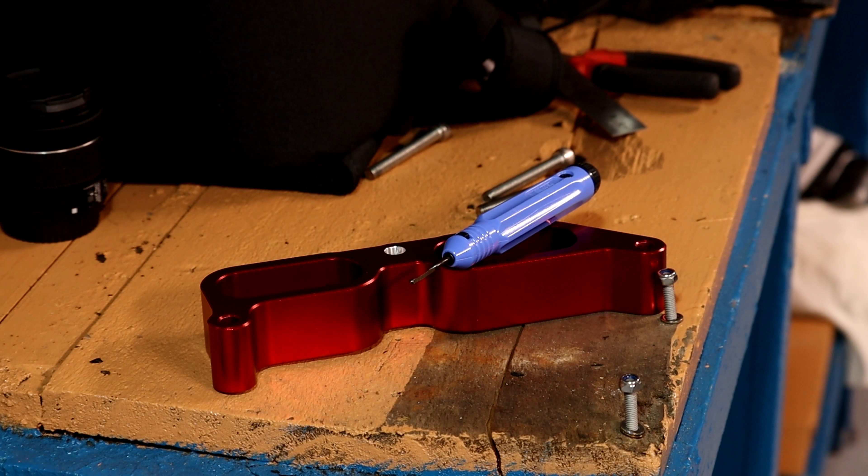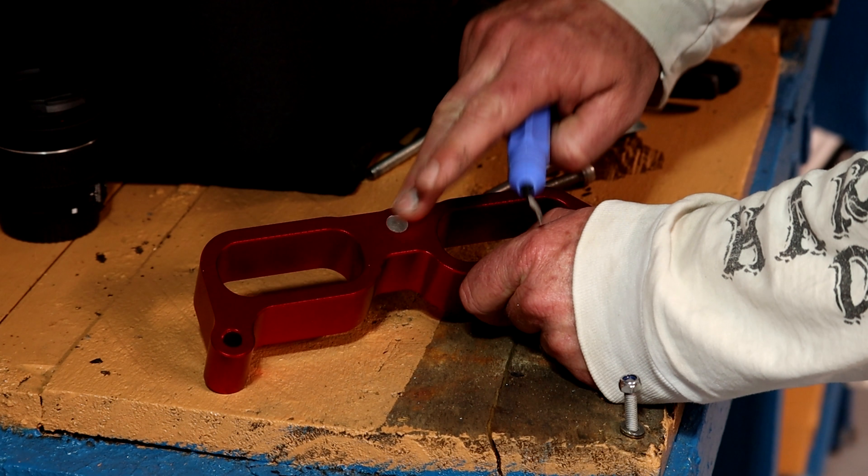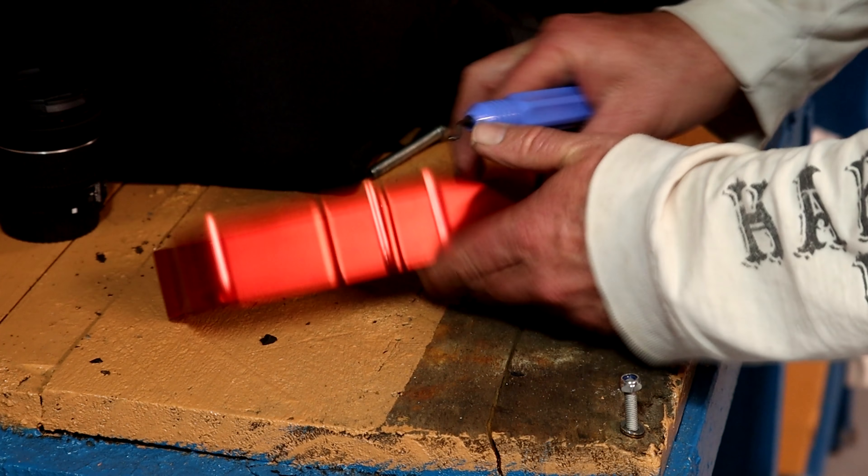We've run the drill through so I've just cleaned up the edges with a file and a deburring tool. Looking at it, you can just see there's some anodising left here — it was quite a little teardrop shape. The drill started in the proper place on top when they drilled it but it hasn't gone through straight — that's where I believe the inaccuracy has come from. An extra millimetre on the hole is not ideal, and if I paid $500 for the kit I'd be upset, but at $158 delivered, not so much.